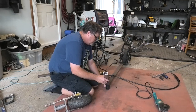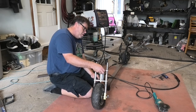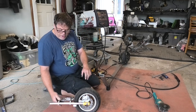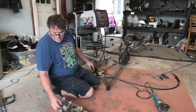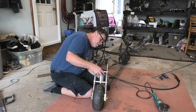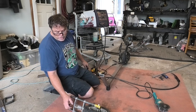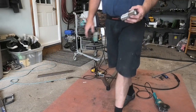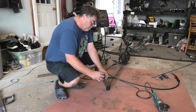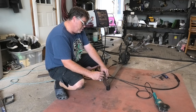There we go, let's try it — six inch spacer. There you go, frigging right. I might notch that a little bit, make that a little round there and clean that up. It will notch right in because that's almost the same width. That will be nice. So let's get the grinder out and try to grind that off. I should probably take this off so I can grind it out better. Now that that's off, we'll grind all that flat, do a little bit of a groove here, then we can get her on. We'll weld her like that and put a little brace across here too — this thing's going to be solid.